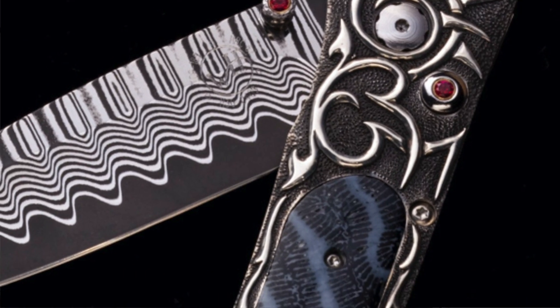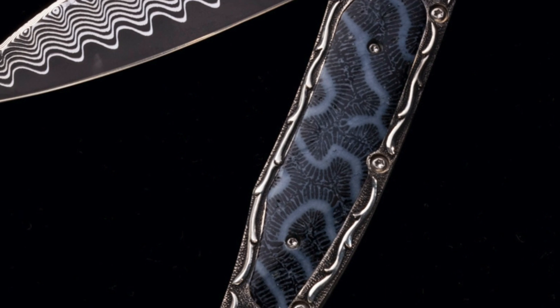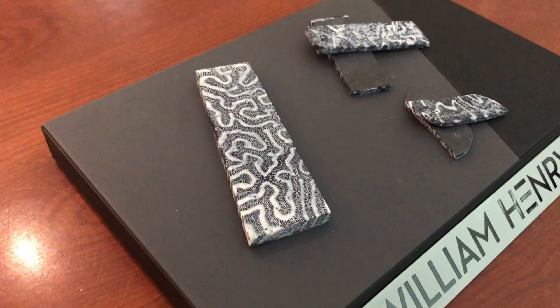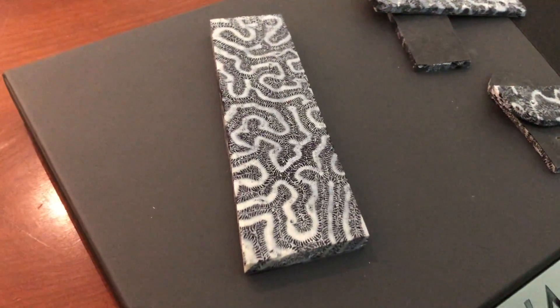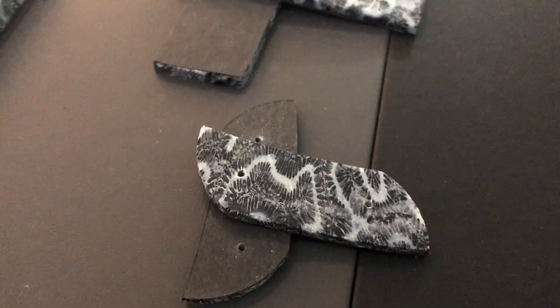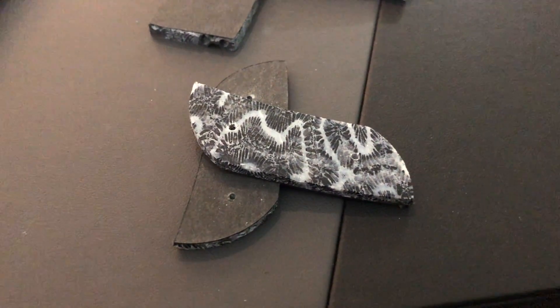For us to be able to work with it — once we get those pieces from him — it's coral and it has been stabilized, but coral isn't the strongest stuff in the world. It's relatively brittle. So if we're making a knife scale or an inlay for a knife or a money clip, we flat sand it, get it into a rectangular coupon shape, flat sand one side very flat, and then we actually laminate a vulcanized fiber backing to that piece of coral. That gives us stability and rigidity so that we can machine, shape, and polish that coral without it wanting to break along the grain lines.